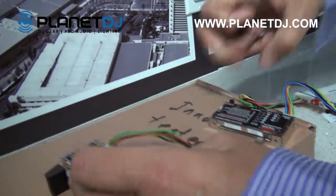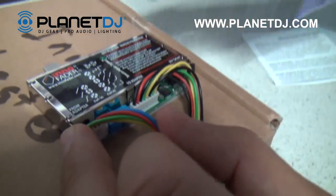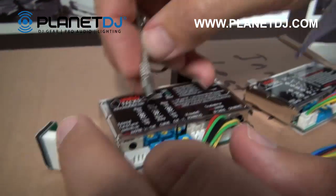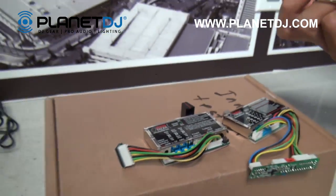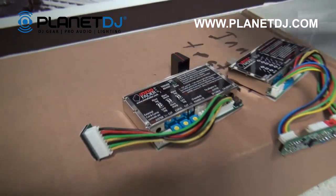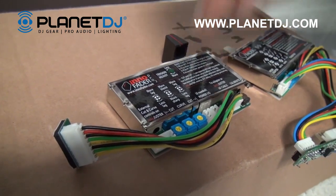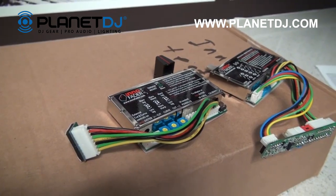And the other thing we did to make it easier, we have the cut-in dial. It used to be a cut-in for both sides, and the curve. And now on the Innofader Pro 2, we have separate cuts for the left and right. And what that does, there's two things. One is that if you're working with a Rane mixer, we had a lot of issues. People with Rane mixers could not get the left and rights the same, and it was a real pain. But here, if they're a little off, it doesn't matter. You just tweak them for each side, so you don't have to try to balance and recalibrate. It makes the process much simpler.